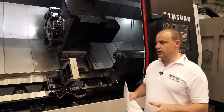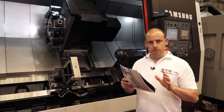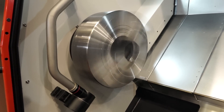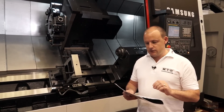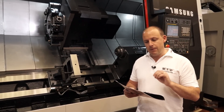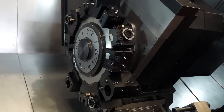Other areas of interest on this machine include: as standard it's a 15-inch chuck. You also have 117.5mm bore or bar capacity, so if you want to feed shaft down the spindle you can do up to 117.5mm. The turning length on this machine is over 2 metres. The swing over the bed is 975mm, so you've got almost 1 metre of swing. And for cutting diameter — which is all important — we've got 620mm in cutting diameter capability.